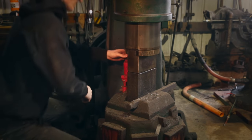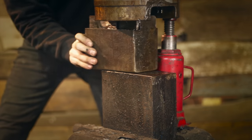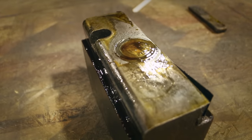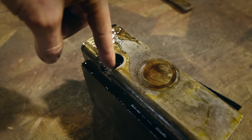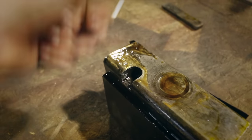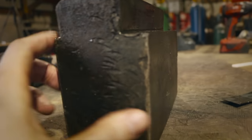I've got a jack on the back here — just going to jack the ram up a little bit so I can pull the die out. So here's the die, and this part is missing. There's a pin that sits in here that goes up into the ram to keep the die from sliding out. If it ever came loose and went up, you'd self-destruct your hammer. We're going to have to make that up, and then there's the gong show of shims and wedges — hate that.